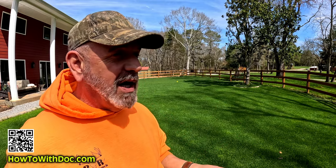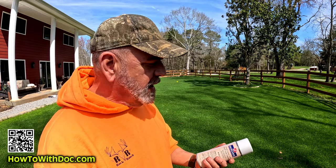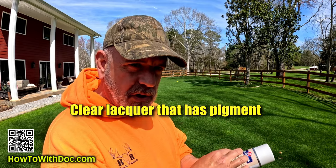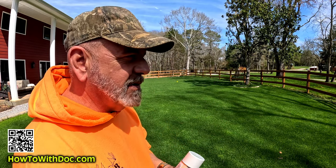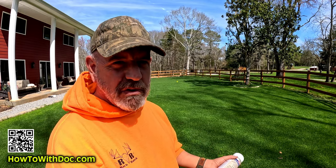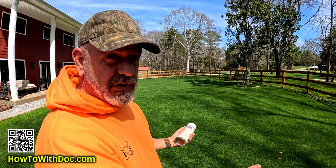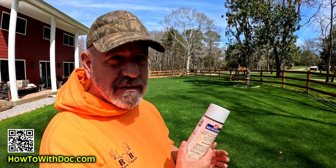This is Mohawk spray toner. I've used this over 25 years ago — I helped some friends open a furniture store, actually a finished and unfinished furniture store where they did custom finishing for customers, and I really learned how to use Mohawk spray toners. Basically this is a clear lacquer that has been toned to several different wood tones. You can fade in around the edges, take a piece that's brown and turn it a little more red, or take a piece that's red and make it dark brown. You don't have to sand it. All you have to do is clean the surface off and test it to make sure there isn't a reaction. For the most part, this stuff will go over any kind of varnish, any kind of urethane, anything. Just clean it off real good and then spray tone it.